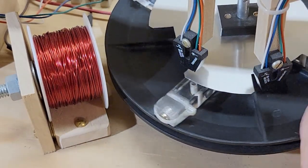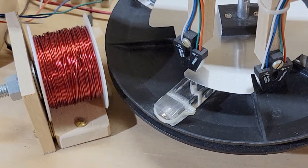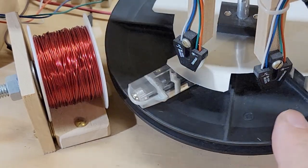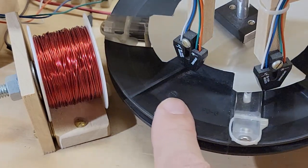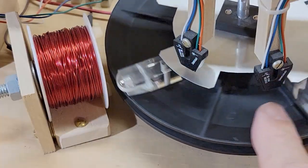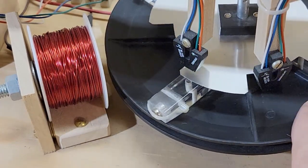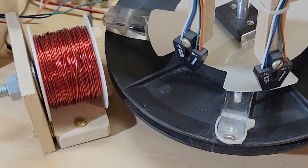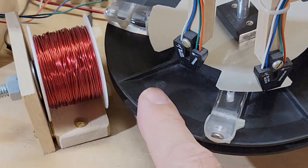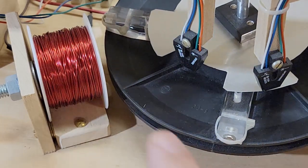The rotor is a six-inch nylon pulley mounted on a one-quarter-inch aluminum rod. Mounted ball bearings are used to hold the vertical shaft. Four small samarium cobalt magnets in plastic blocks are attached to the rotor. The coils of magnet wire — 200 feet each, 24 gauge — had to be carefully unwound from their spools to access the end of the wire and then rewound. They were mounted on wooden blocks and an iron bolt was added to focus the magnetic field.